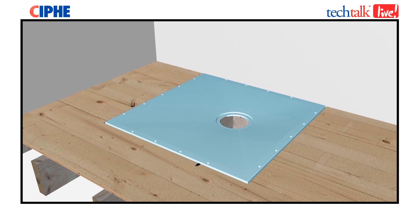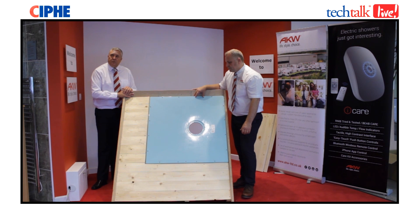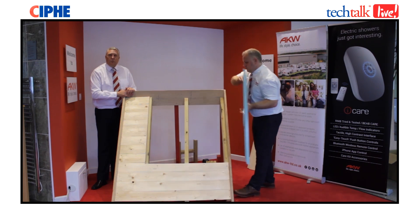The actual former is 22mm; floorboards are 18mm, and in many new properties it's also 22mm. Once you've worked out where the position of the actual waste is going to be, you can mark underneath with your joists exactly where the centre point will be, and from there you need to put your supports.